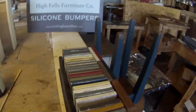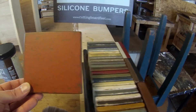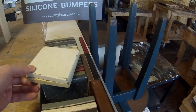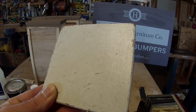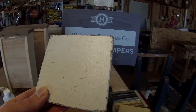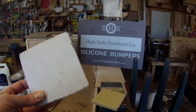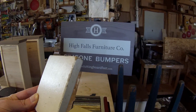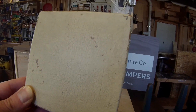I'll show you some of my samples here — this is from the High Falls Furniture product line. The type of effect I like to go for is very fine, barely noticeable cracks in the paint. That's achieved by applying a very thin coat of the crackle and concentrating on the areas on the corners where you want to remove the paint later on. This sample is showing more of the crackle detail.